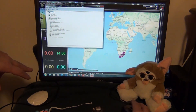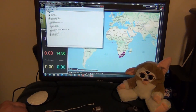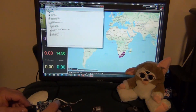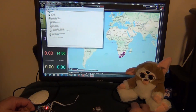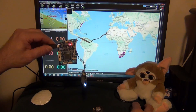The other thing you need besides Mission Planner is Device Manager — it's built into Windows. Go into your start prompt, type in Device Manager, and it'll pop up. You'll see it says Arduino Mega 2560 — I'm on COM 19. Watch when I disconnect it — it's going to reboot and disappear. When you plug it in and wait a while, it'll load the drivers, but it might take up to a minute or two before it actually recognizes it. So don't keep playing with the USB cord. Once it's recognized, the board lights up and you've got COM 19.